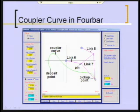So it comes up out of the nest nearly vertically for a short distance, rolls over, follows this path. The orientation change can't be seen in this picture. This is just a track of the tip of the grabber, so you don't really see how it's changing angle. And over here, it comes in and drops it in the chute and over travels slightly. By about this point, the air cylinders have given up their grip on the product, and it's fallen into the chute. And they wipe it off, essentially, with this excess motion.